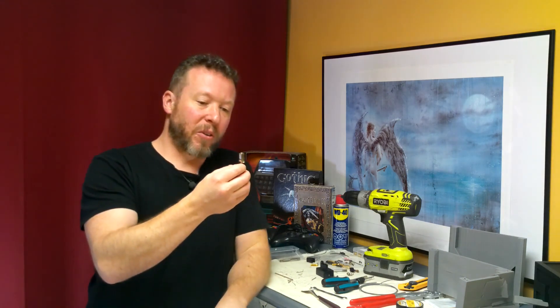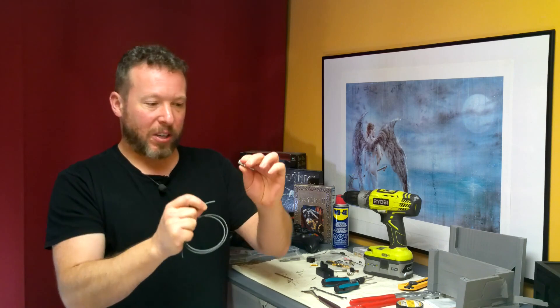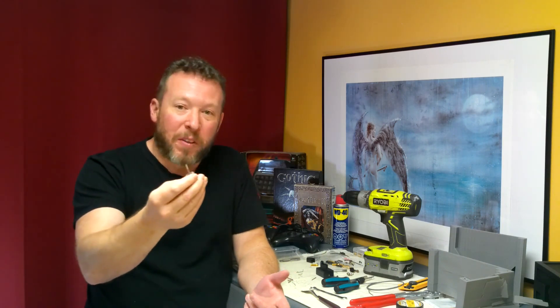Exchangeable nozzles don't help. So I switched back to the coated nozzle — the original one from Sovol. And then this door panel didn't finish because once again the filament got caught in the filament runout sensor — same deal. The hotend itself is still obstructed. I can see that thin layer of PETG in there, and I went through with a drill bit as well. Maybe I could put it in the oven and warm it up and scrape it out. It was in printing mode without flow through the nozzle, and the entire PETG got overheated and stuck to the inside. This thing is so clogged up — I tried the poker and whatever I could find. It's so caked on in there. Unbelievable.